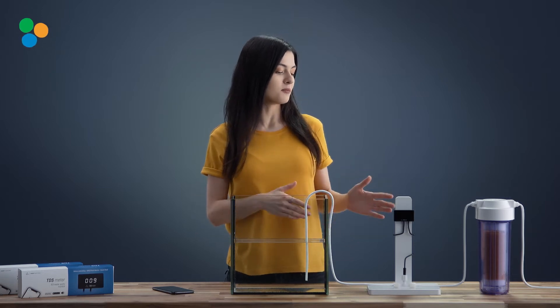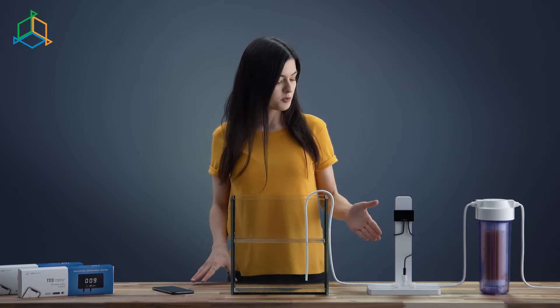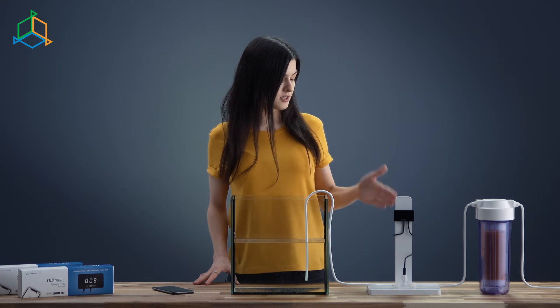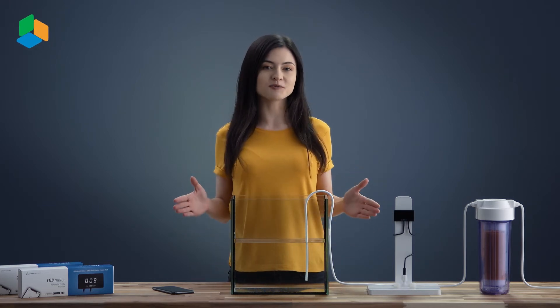For the purposes of this presentation, I had the device installed on my holder. You should install TDS Meter near the RO filter. The next step is to connect the tube tee to your RO filter tube and to connect the sensor to another end of the tube tee. Here you can see how it should be connected.